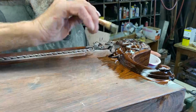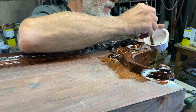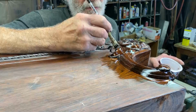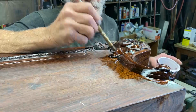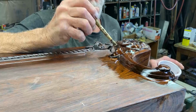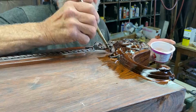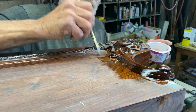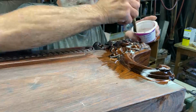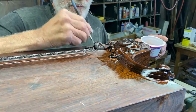This is going to be a finish polish. In other words, all our boo-boos are taken care of. All the veneer has been replaced, and while the piano's on its side here, I'm going to put a nice shellac on the side here. No silica this time, and leave that behind because it's too hard to sand. Where's the sandpaper at? There. And can't get in here with a French polish either, so we'll do this. Looks pretty good actually.